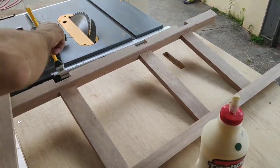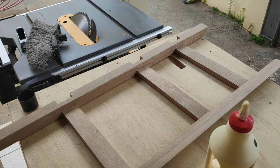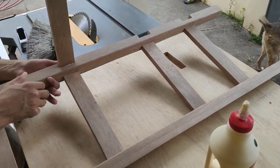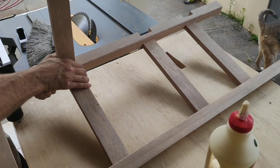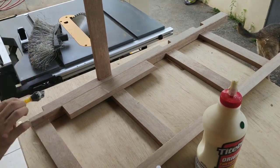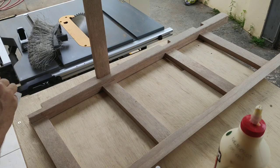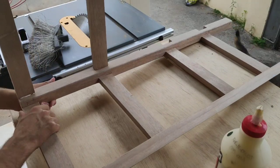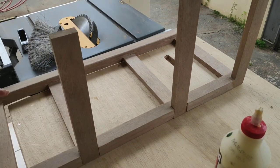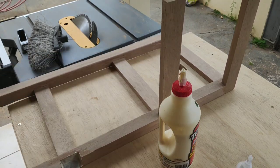Let me share with you a trick to glue up something that is not easy to clamp. That's the sound of Whiskey and Tequila asking you to like, comment, and subscribe. This is Tequila, by the way — she is the head of human resources here. The trick is just to put a drop of CA glue with the regular wood glue when joining. The CA glue is not very strong, but it should keep the surface steady while the actual strength comes from the slower drying wood glue. The CA glue basically acts as a makeshift clamp. And since this was a place that was hard to get an actual clamp, it should do the trick.